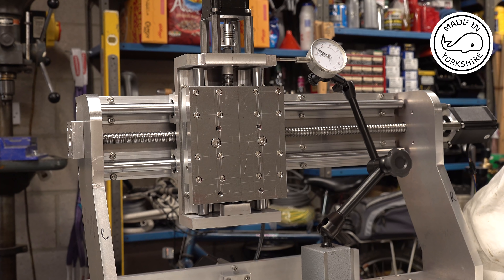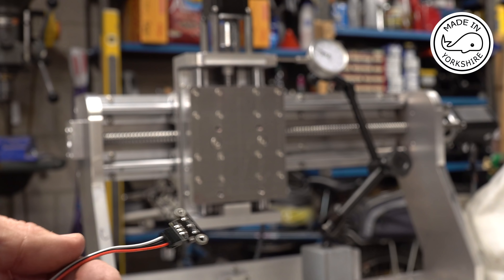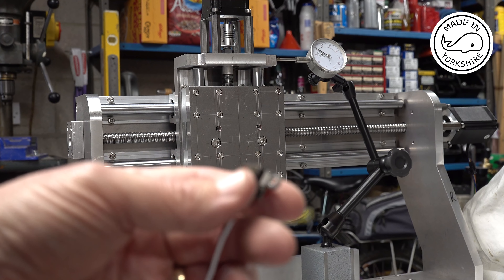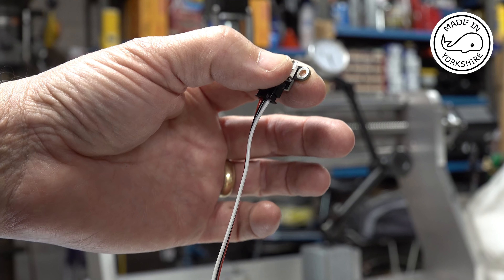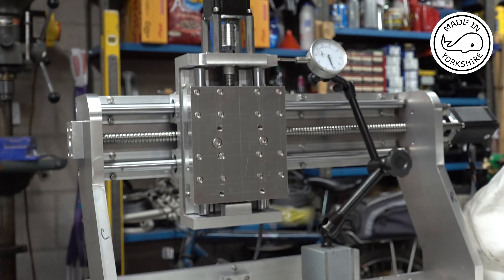There's another strange anomaly. I've connected this limit switch up to the X-axis and I've checked that the connection is right, so that creates a closed circuit when I do that. But unfortunately if I close the circuit and try moving the X-axis, it still moves. So I don't know whether that's some kind of setting on the controller that I need to investigate. But apart from those two things, it's looking extremely encouraging.